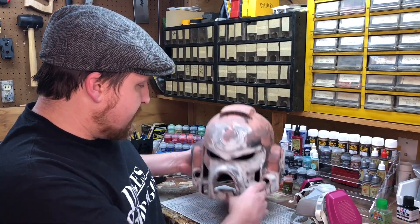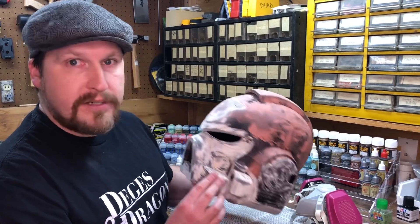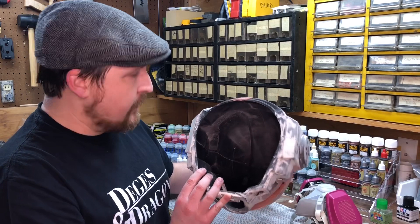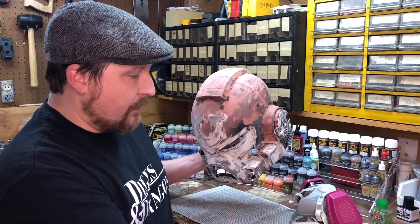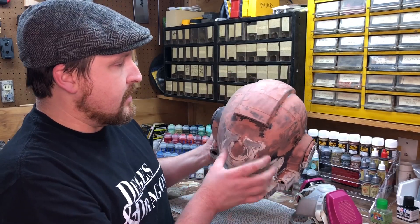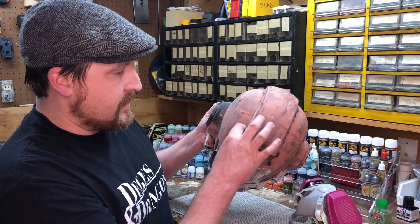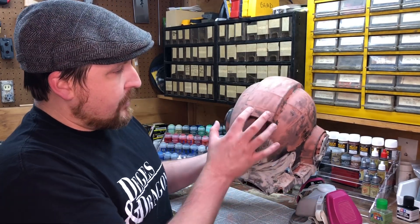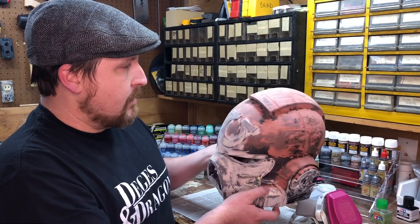Based on what I've seen here today, the wood filler might be my new go-to. It's easier to apply, easier to clean up, and easier to clean up your workspace and tools when you're done — you don't even need a putty knife. All around it's just a cooler thing to work with. Don't get me wrong, I'm not getting rid of the Bondo. I think Bondo is better for filling up large volumes when you're really trying to get it done. Up here, you can see I used Bondo to fill in basically this little trough where the two pieces wanted to be further apart, and even then it still shrunk and cracked as it dried up. I don't think the wood filler could really fill in that big of a void without drying up too much and splitting apart, but we'll find out.